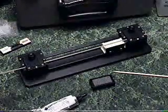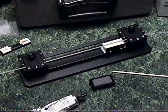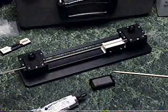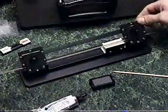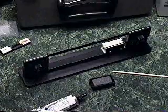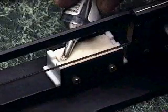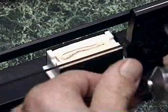The next steps need to be done quickly and without interruption because of the fast drying adhesive used to bond the fibers. To apply adhesive to the lower applicator mounted in the shuttle, first raise the fibers by lifting both clamps upward. The shuttle is still positioned at the cable end of the track. Uncap the adhesive and apply a thin bead, approximately 3/16ths of an inch by 1 and 1/2 inch, lengthwise along the center of the lower applicator. Quickly cap the adhesive and set it aside.